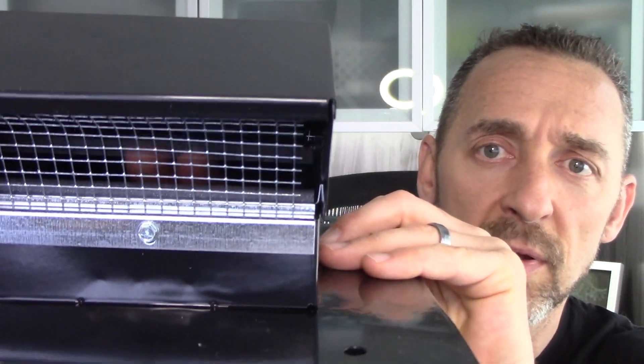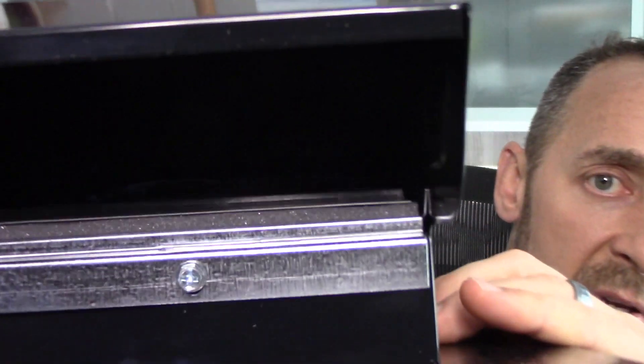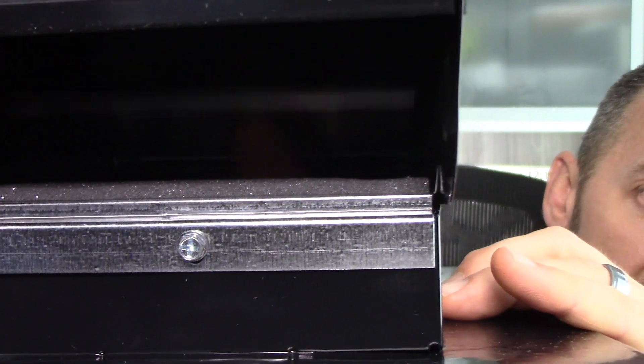You can see that there is a damper in here. Let me pop this screen out — now it's a little easier to see. There's the damper going up and down. So that's what it should look like. If it's proper, you'll see a damper inside there, and the backdraft damper is going to help reduce the amount of cold air that just dumps back down into that duct.